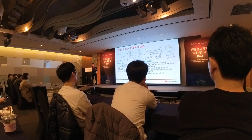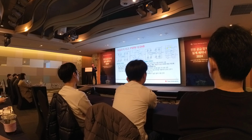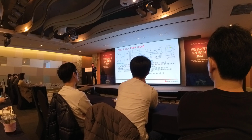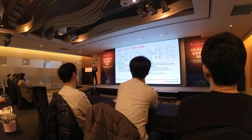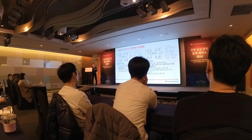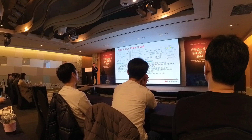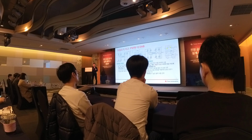And the other thing is, this controls the phase difference between the primary and secondary windings. We call that single phase shift control, right? Under single phase shift control, you can see a lot of circulating current through the resonant stage, and that will cause a lot of losses. So it's possible to apply multiple phase shift control. Instead of only having the phase difference between the primary winding and secondary winding, you can also include the phase difference between the two primary legs to minimize the circulating current. But as you can imagine, by doing so, the control complexity will be very high. It will be pretty challenging to control.